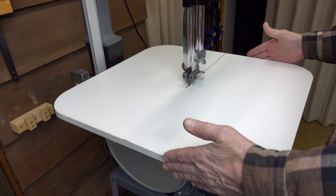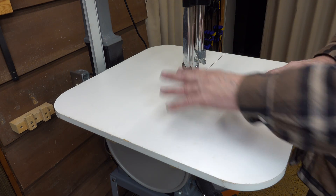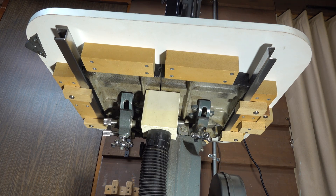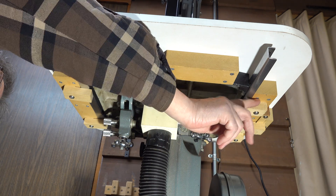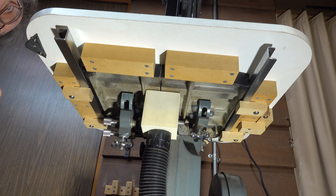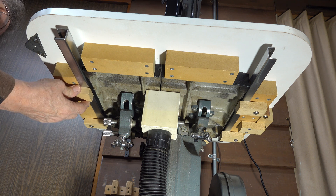And instantly you've got about 24 inches to work with. It becomes really handy when you have little pieces falling off the table, or you have long strips — you get that little extra leverage advantage of the table. Now here we have the actual trapping of the face rail and the rear rail with these twistable pieces that captivate it. All you need to do if you want it to never loosen up: when you make your screw holes, after you've run the screw in once, take the screw out, put a drop of thin CA super glue down into the threaded hole, let that soak in, then run your screw in again and you'll find it has a lot more resistance. At that point it shouldn't back out and turn on you anymore.